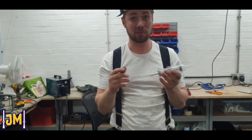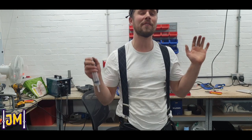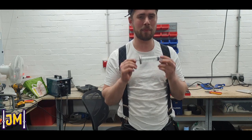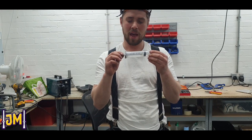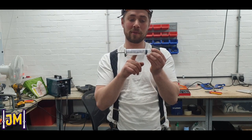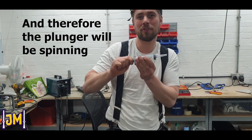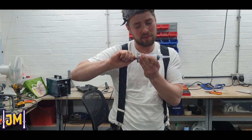Okay, so slight problem. The issue is torque. If you watched my last video, you'll know that the Wiha Speed E doesn't have a massive amount of torque. Now, it's okay for what's needed, and perhaps when Wiha were designing the Speed E, they didn't really think that people would be using it for this purpose. Also, what I didn't realize was that the threaded bar will of course be spinning, so the connection that is made between the threaded bar and the plunger will also be spinning. This adds a lot of friction, and I can't use my hands to move the threaded rod.